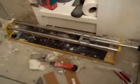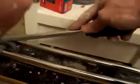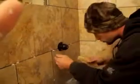Then we are also using what's called a breaker board. This thing is extremely useful. All you do is pop your tile in it, you put it under, you take your score, it's got a little blade down there, a little roller. You push this lever down and you score down. Then all you need to do is take either a mallet and basically break that other piece off, or you can bust it off by your knee. It's either or, whatever best works for you.